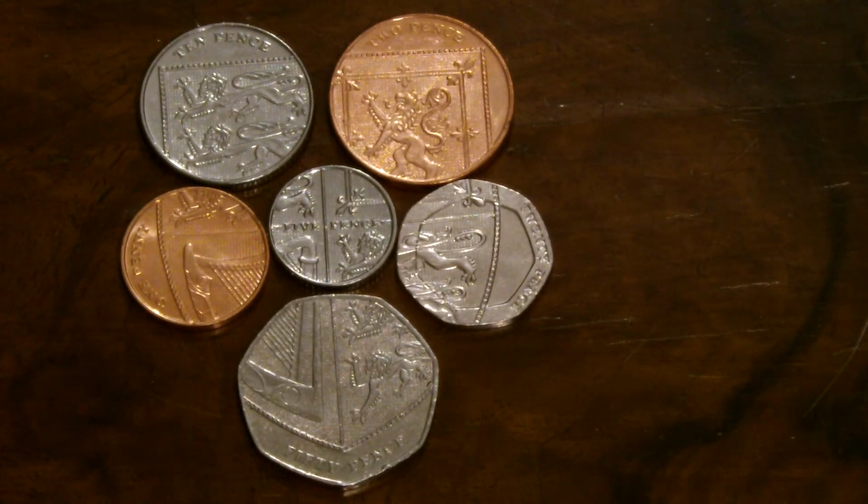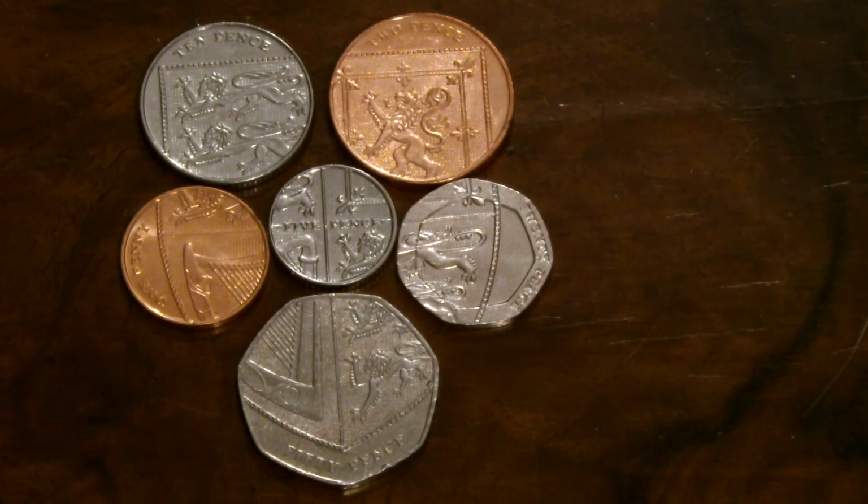So you quench the front of it very, very quickly, so you have a hard, very firm, very sharp cutting edge. But then the bits further back cool more slowly, so you have more of the flexibility, so it doesn't just shatter the first time you use it.